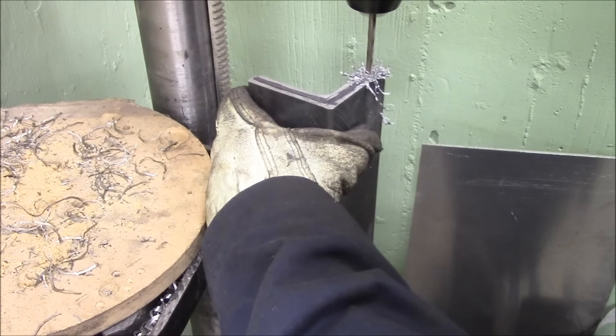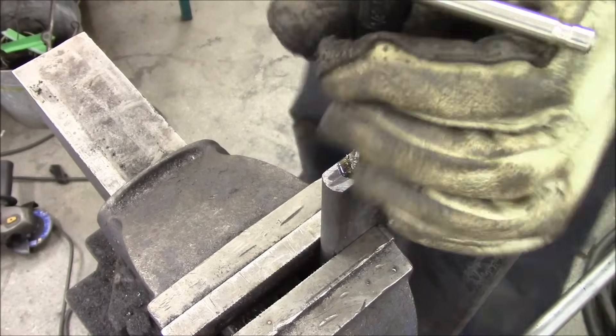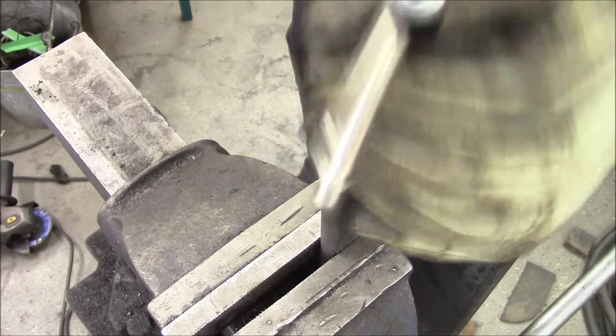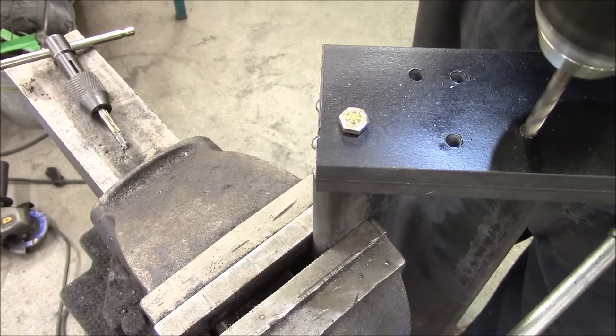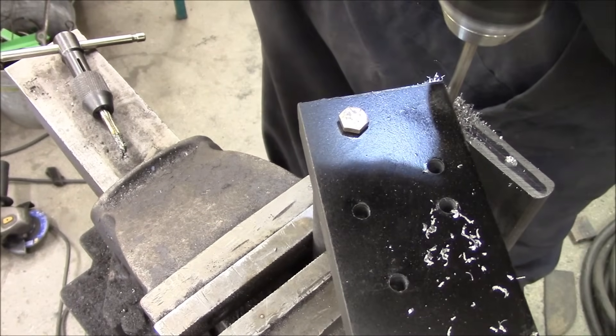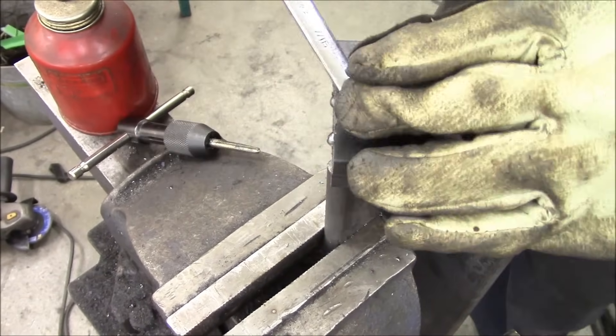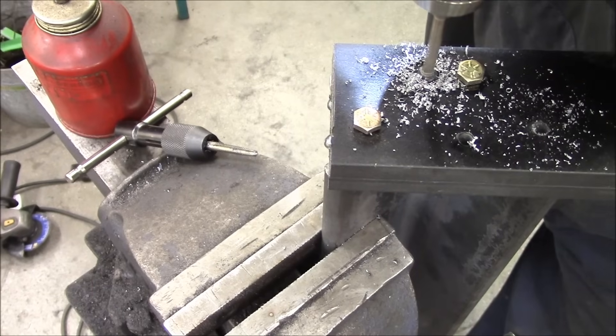This drilling was scary as heck — don't do that. If you're smart, you'd put it in a vise so that all of your effort can go into work instead of half your effort going into holding it. But this part you really want to make sure you're very, very precise in how you're laying things out and where you're drilling the holes, because this will come to bite you a little bit later on.